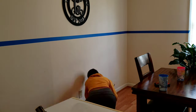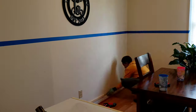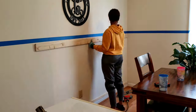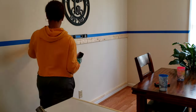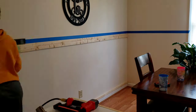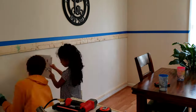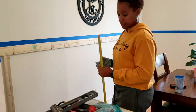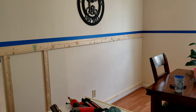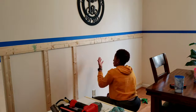I will begin installing my furring strips to the bottom half of the wall. I started from the very bottom, putting that one by two board right over the baseboard - that's to make sure those horizontal boards will be flush to the trim at the bottom without replacing the baseboards. At the top I'm installing the one by four furring strips, and then the one by threes go vertical down the wall. I decided to space mine out 16 inches apart, using liquid nail and my nail gun to get the job done.